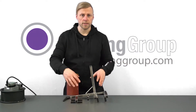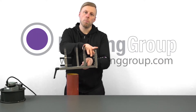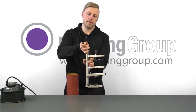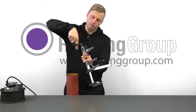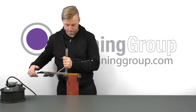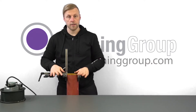Now I'm going to show you how to attach the fastening device to a pipe. First, you may roughly want to choose the distance. This distance is good for small pipes — DN70, DN100 — for bigger ones and for even bigger ones. You make sure these feet are in the right positioning. Then you open the distance until it fits around the pipe, and you connect it by tightening this screw, connecting the fastening device to the pipe.